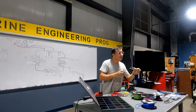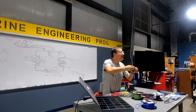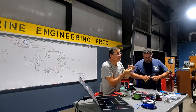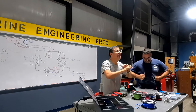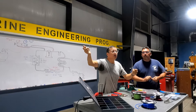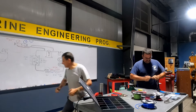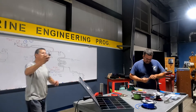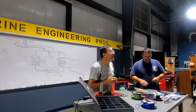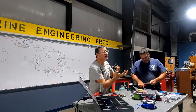For that reason, in the posts of the battery, you have lead and copper in the terminal. Oxides are produced — oxide of copper, green color, and oxide of lead, silver color. Both oxides together create a perfect insulator. In some cases, you see the terminal on the post but you have no power, no voltage — because the powder between both metals isolates them. Periodically, you need to clean the battery terminal with a wire brush, and clean the cable terminal with water and baking soda. It produces bubbles and removes all the corrosion.